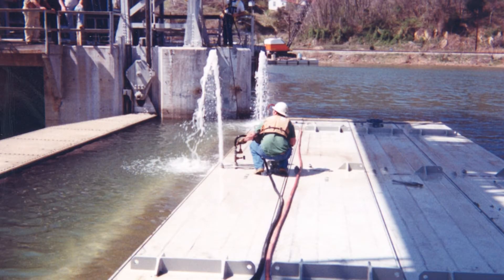This bulkhead is in the process of removal. Air is being pumped into the caisson, evacuating the water. This bulkhead was installed with the garage door technique and the bulkhead is rotated into the horizontal position just like a normal garage door. Note that the area between the gate and the bulkhead is flooded — that is what the bypass valve is for: to flood the space between the bulkhead and the gate to take the upstream water load off the gate.